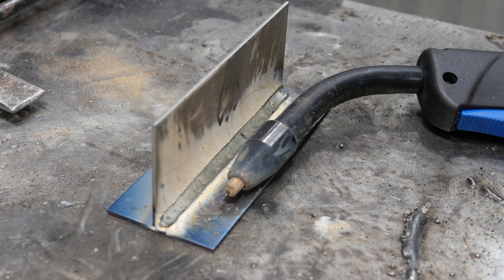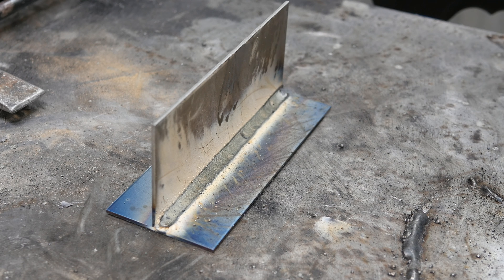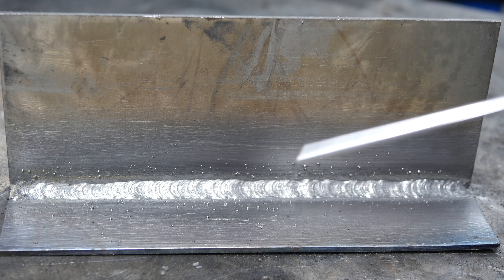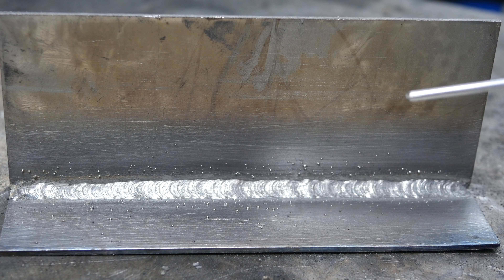Blowthroughs on this thinner material are very common. All right, that turned out pretty good. No burn through. I did have to use a little smaller contact tip to work distances, about a quarter of an inch. I'm going to get this slag off here, and let's look at the results. And there it is — pretty nice looking bead, a little bit of spatter. That just comes with the territory with running this wire on a low procedure, so we can weld this 16-gauge mild steel.